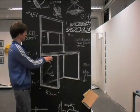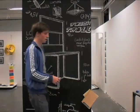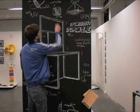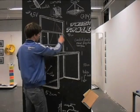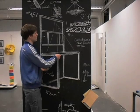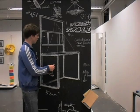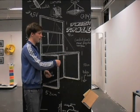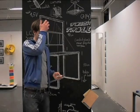This is the touch table. What we are able to do on it is we are able to have a finger piece, and we can use this to send out an infrared light, which can be seen by the camera here, which sees the surface of the table looking downwards. According to the position of the infrared light on the table surface, we can interpret that with the computer and use it as our mouse pointer. We have a projection coming from the bottom against the surface, which allows us to interact with our computer on this table, and this is supposed to change the way we interact with our computer programs.